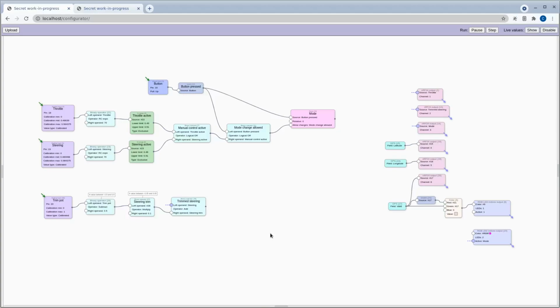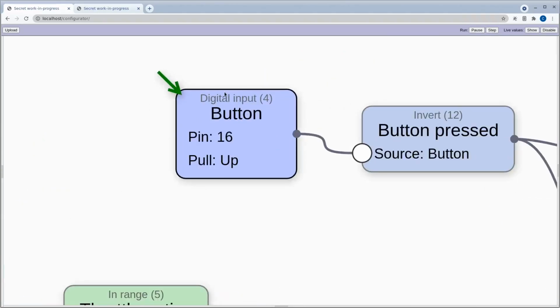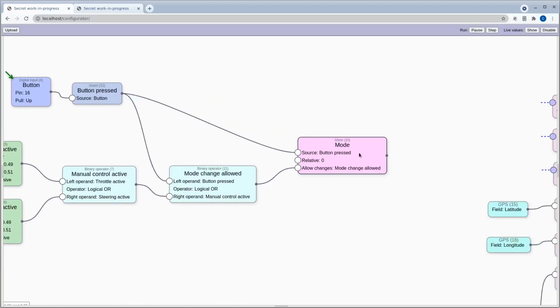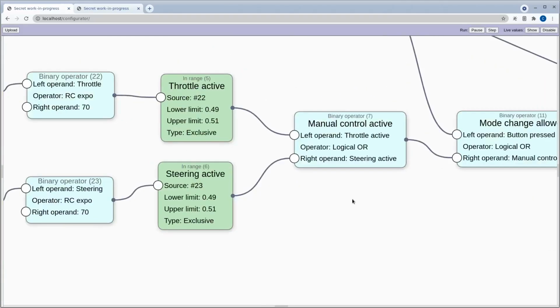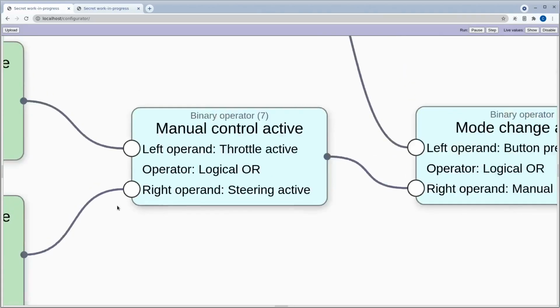Anyway, let's take a look at it, and I'll try not to get bogged down looking at every little node individually. I'll just look at the large picture, one of these blocks of logic sections at a time. This section here takes our analog inputs from the throttle and steering, that's the joystick, and we also have a digital input from the button. And we have a bunch of logic here which decides whether we should be in autonomous mode, the follow me mode, or manually controlled mode. That's stored in this store node there, depending on the input. The way this works is that if either the throttle or the steering is moved away from the center, then that cancels the autonomous mode.